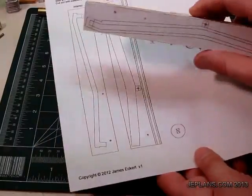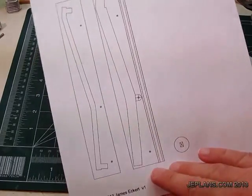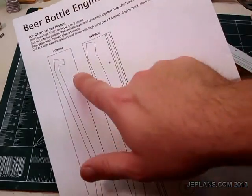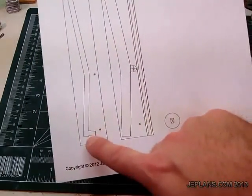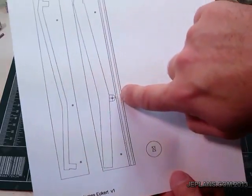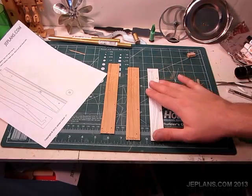You may notice my plans change from what I have marked on the blocks of wood - that's because I am constantly refining the plan, I make it up as I go. But this will be my interior pattern that will allow for the openings and these parts that extend out. The holes are where it attaches to the engine, but the other ones are just to help line up the patterns. So here they are cut into their three pieces.